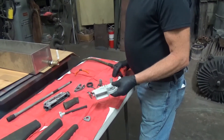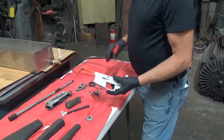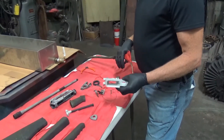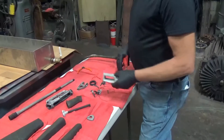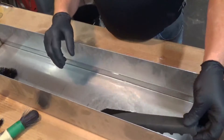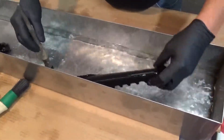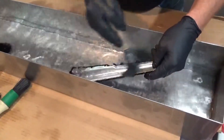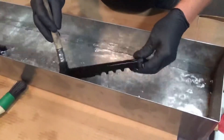Now after you're done with the sandblasting, make sure you get all the little nooks and crannies and blow them out with air before your last clean. That way it won't gum up or stick in there. The air pressure will push it out and then the virgin acetone will get in there and break anything else out. This is our last step before we go to paint - cleaning all of our parts in acetone to remove any oils left on the surfaces. We want to make sure our paint adheres and stays there.